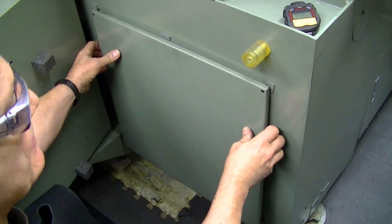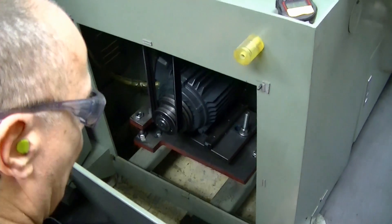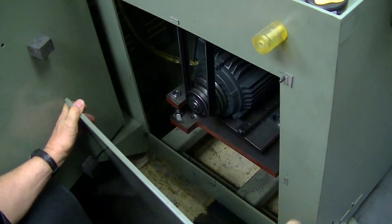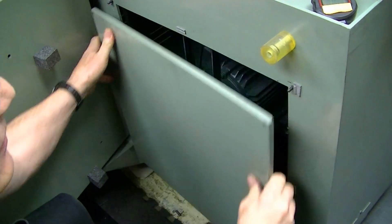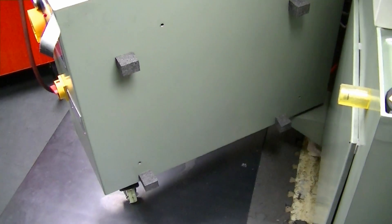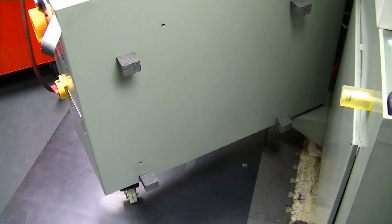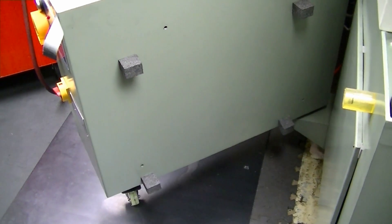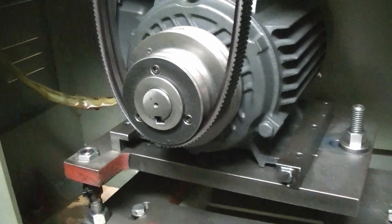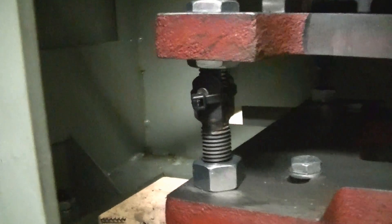In order to have this panel not be a time issue, I just put studs in here and some conforming foam sticky tape so it doesn't rattle, such that this can just be ripped off and put back on again. The four foam pads press on the cover plate and hold it tight to the machine so that there's no need for any bolts.